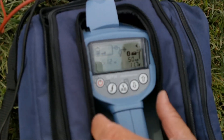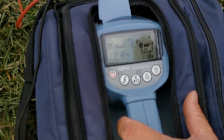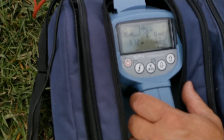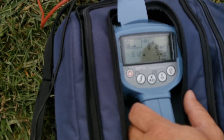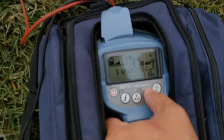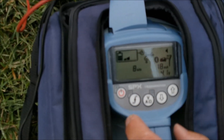Your battery life is up here in the left-hand corner — you can see we have about 66% left of our battery. This runs off of alkaline batteries, eight alkalines, but you can get the lithium ion rechargeable if you want, which will last a lot longer — about 10 times longer than alkalines and recharges over 700 times. So, the up-down arrows control your output, the F key changes your frequency. I'm going to go to eight kilohertz — I've got two bars of output and 20 milliamps.